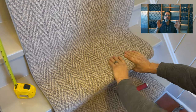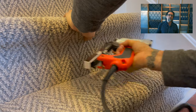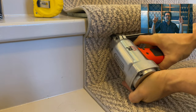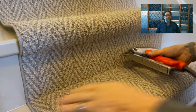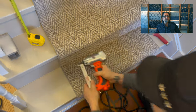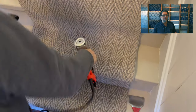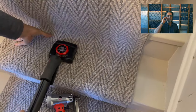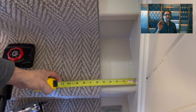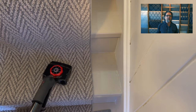If you're installing this DIY, this is the method you want to use. We preform again, then staple under the nose one to two inches, two on the end — because the ends can pop out and you just don't want that. I use a lot of staples. We measured again: five and a quarter at the back, five and a quarter at the front.